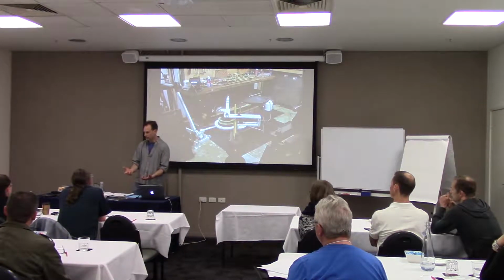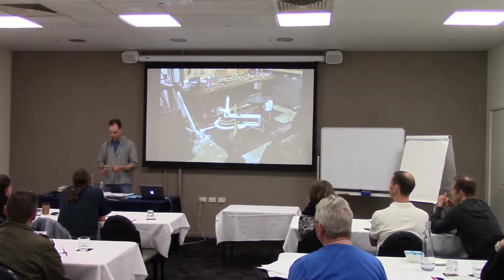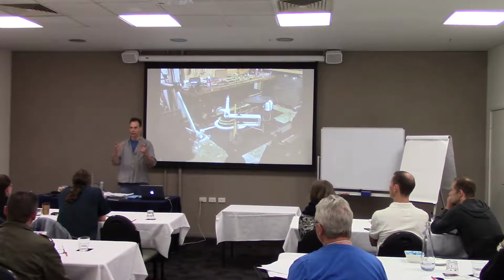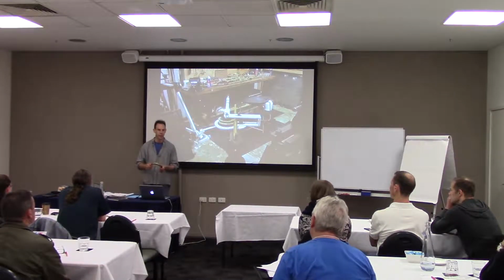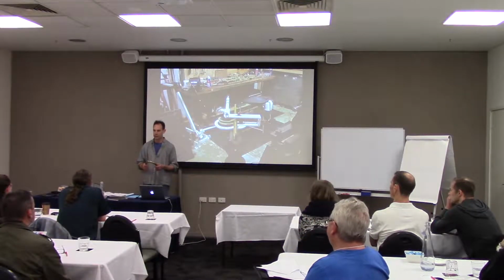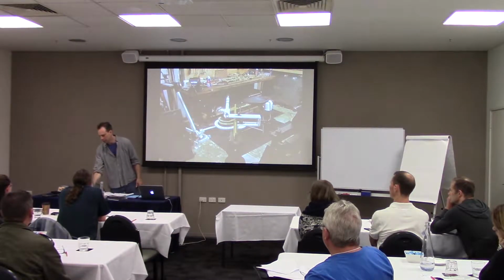But that leads on to, well, I had to do this tuba, this York thing. It was a conversion from a 3-valve upright to a 4-valve front with a 5th. And so, of course, the 3rd branch doesn't wrap all the way tight. It won't fit over the 4-valve section. So you had to make a new one. And I'm like, it doesn't exist. What am I going to do? So I make these out of flat sheet, and that's where you don't have to use a mandrel. You can make saxophone necks, you can reproduce them.